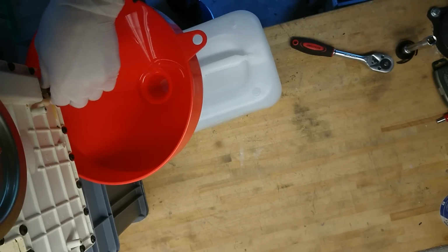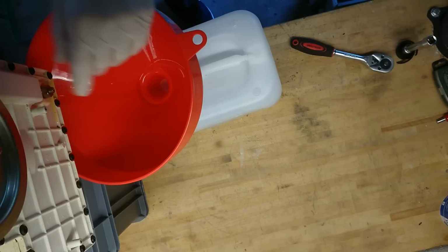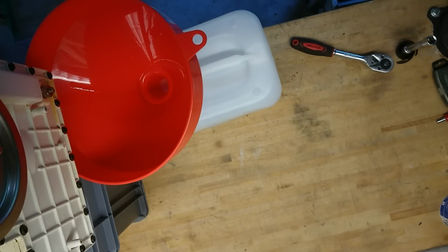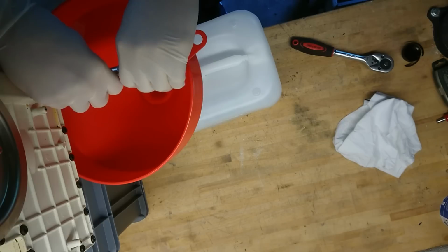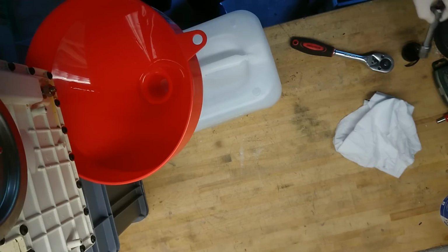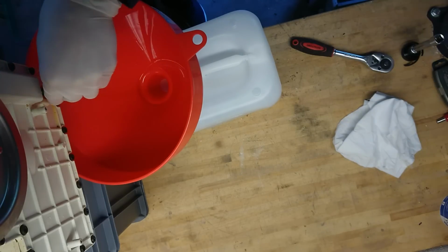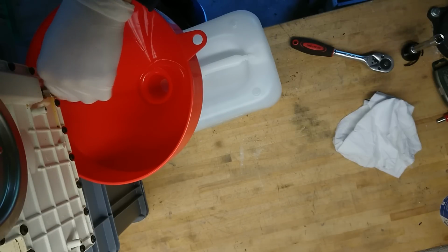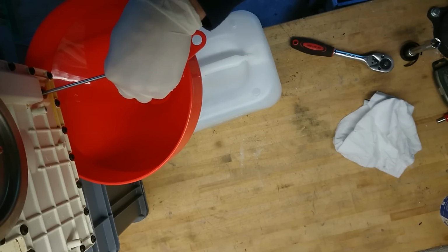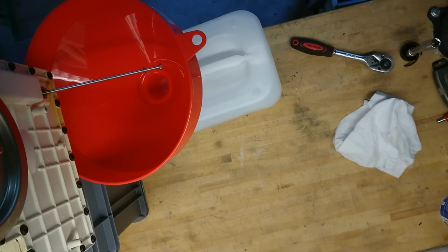Okay, so it has a little spring action, and that also makes sense if it's a vacuum port, as once you have vacuum it should shut close. Okay, so that's not ready to open by hand yet. It's coming very loose now. Okay, so it has a check valve sitting here so it won't just spit out the oil, because it does need a little pressure in order to stay open. So I'll just have to get a vise, a quick grip here.